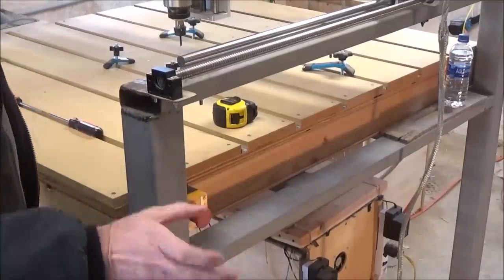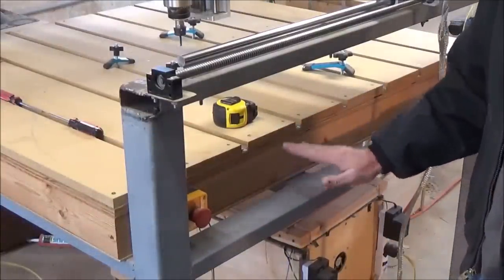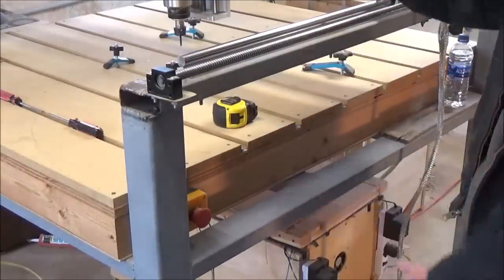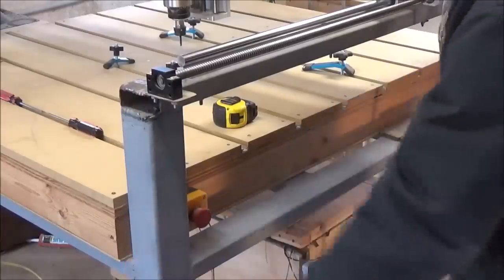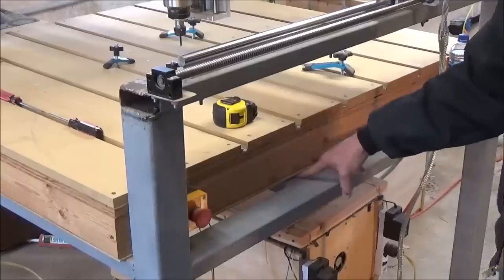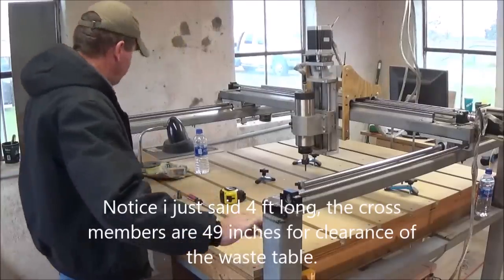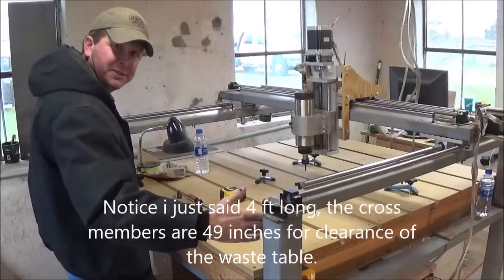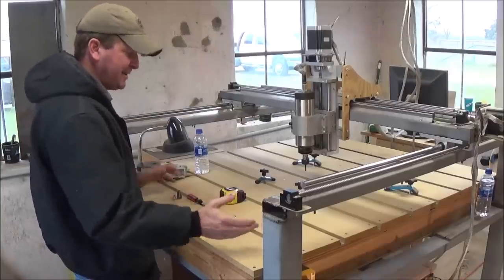I like to have just a little bit of tolerance so if I need to move it, I can. The frame is all steel underneath. When I did my cross members across, it tied this side, which is a mirror to the other side. I tied it within four places — at each end and two right here in the middle. They go all the way across, four foot wide, and it is four foot long. Between my posts on both ends, we are 49 inches from inside to inside.